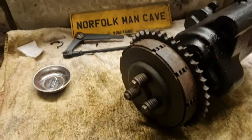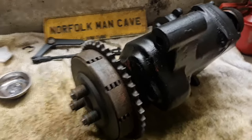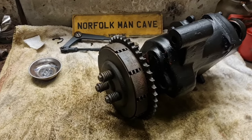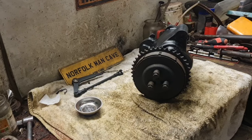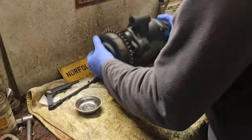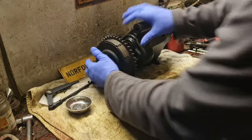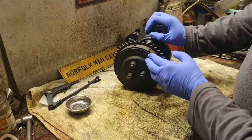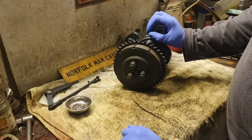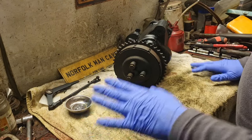Now, I am going to go totally against everything I normally do on my channel, where I say fix what's there, minimal cost. Let me explain. But when I took this clutch off, I was not happy at all with the condition of the pressure plates. The friction discs, yeah, they cleaned up fine. Them pressure plates were really, really horrendously badly pitted.